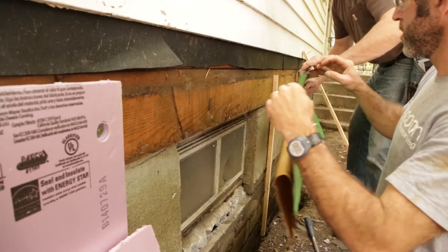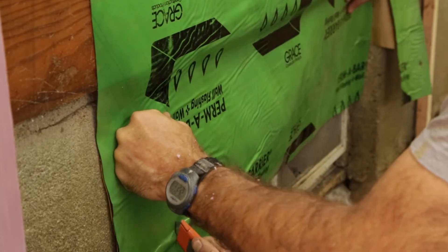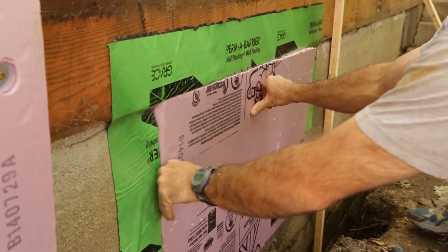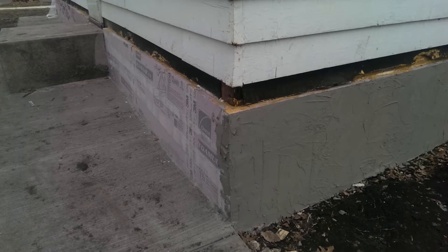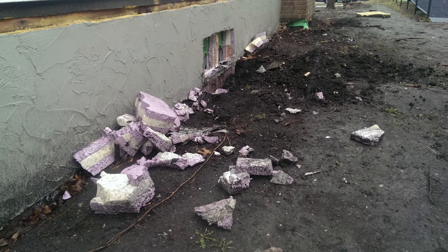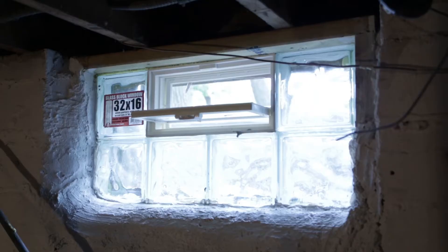When we came to the windows, there are five basement-type windows — we filled them with rigid foam and then spray-foamed right over the top of them, creating a solid foam wall. When this process is over and the foam is installed, the carpenters can just cut a hole where the window opening is and install their frame and their window member.